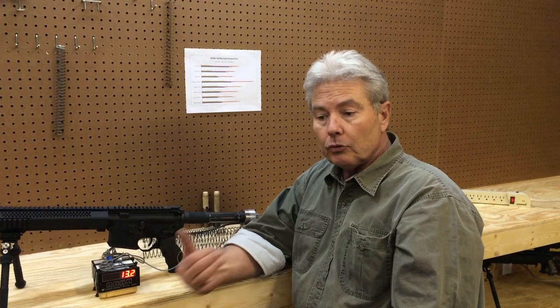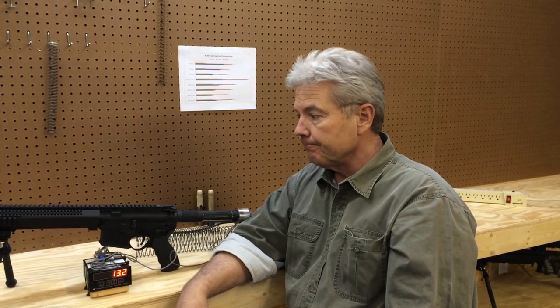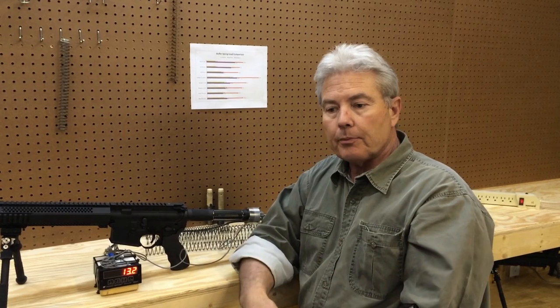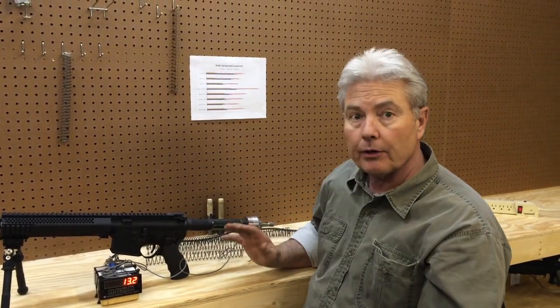So all in all, the flat wire spring products we make at Superior Shooting Systems represent superior technology. Coupled with 17-7 pH and chrome silicon, we make springs in either material — both very good. The chrome silicon spring is maybe not as durable in a harsh environment, so personally I'd opt for the 17-7. There's no question that one of these springs operating in two and a half inches of stroke will slow your bolt carrier down, let your case eject, and go back to battery with consistency — and in the end, it makes you faster.